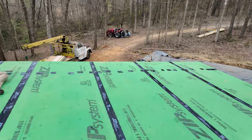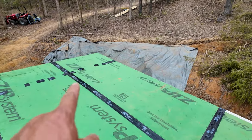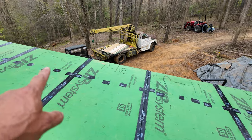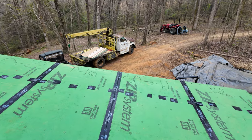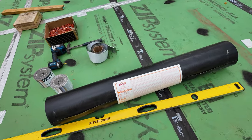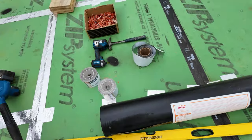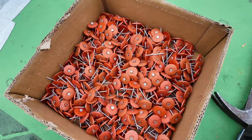Tanya is putting the last bit of zip tape on. We got all the seams zip taped here, and she's putting a little bit of zip tape over every one of the big screws so water can't go down. This is really all for naught because we are going to put on another synthetic roof cover — a synthetic felt. Supposed to be really good stuff. We're going to be using these nails to put them down; they've got a little rubber top on them.